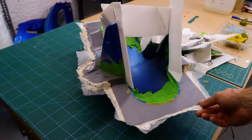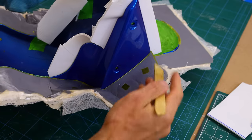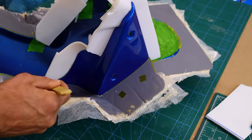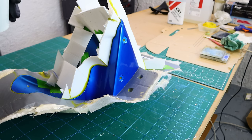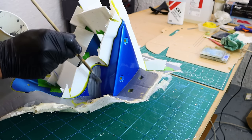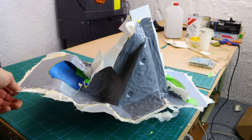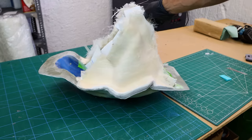Now I can start the side mold. I took off the unwanted fluted board barriers and scraped out the beeswax from the corners. After the six coats of release agent I started applying the two layers of gel coat, then I laminated the fiberglass the same way as the top. I trimmed around with an angle grinder using a suitable disc for stone.